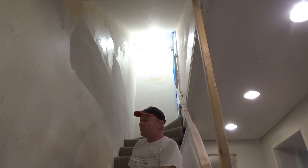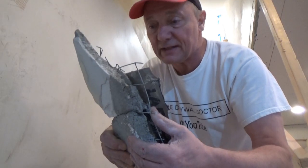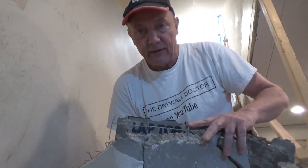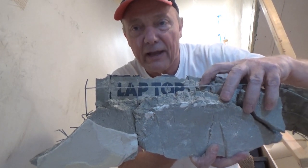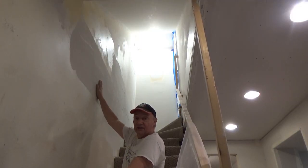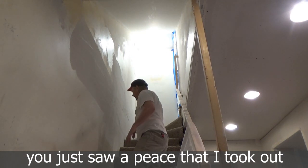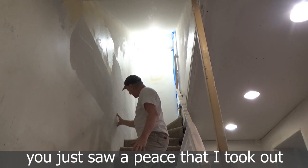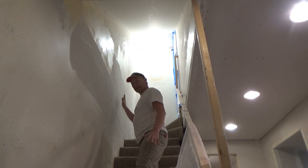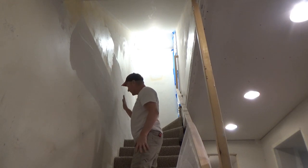This wall is plaster like I've never seen — big heavy wire, screw-nailed and stapled to the two-by-fours. It's a really old house; remember it had lath backing on there, which was kind of cool. What I first did was take a hammer and chisel and bust out the big bow that was in this wall, then cut it all back, cleaned it up, and double-layered drywall in here to try to match the plaster — two layers of half-inch to feather this out the best I can.